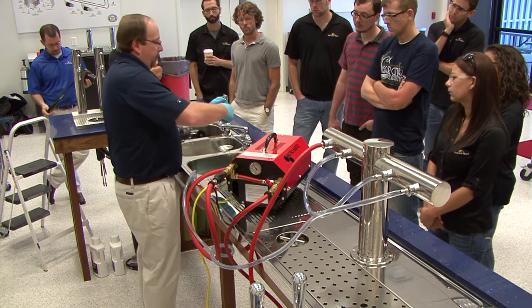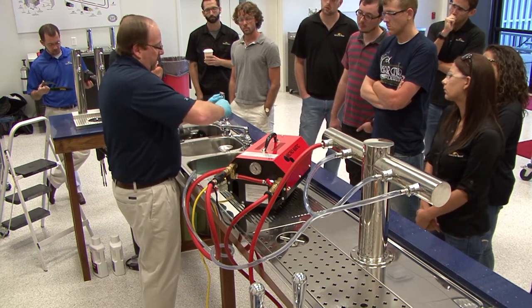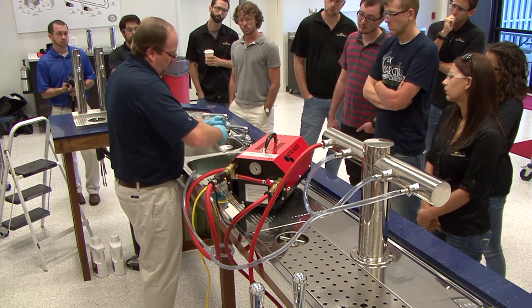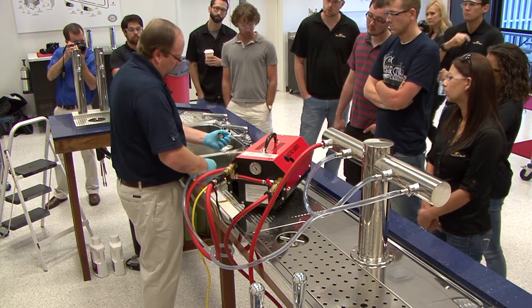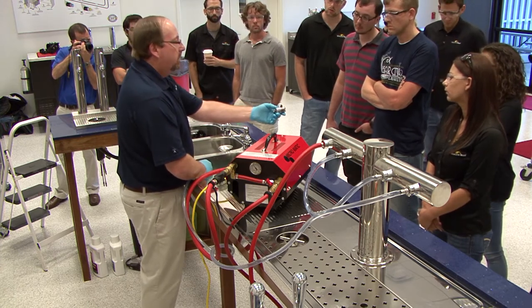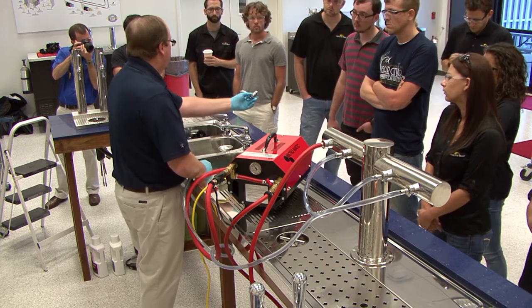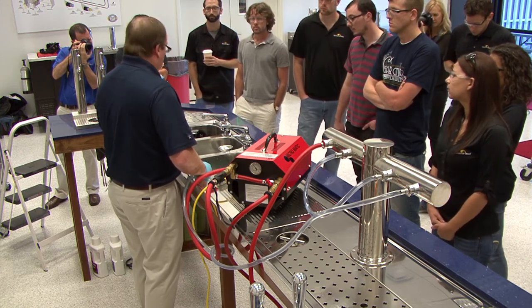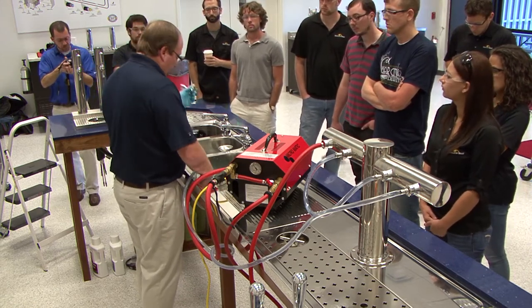This is a large nut on the top of the Guinness-style faucet. You just basically turn this nut off — it gives you access to the whole inside of the Guinness-style or stout-style faucet. You can see that those get really dirty. It's really important to take these apart and brush-clean these as well.